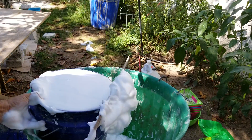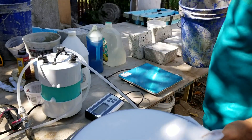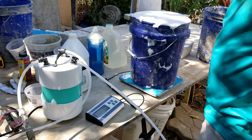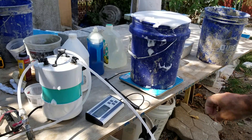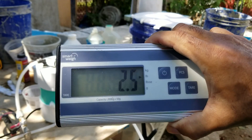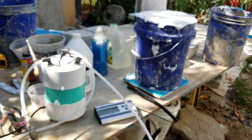Let's take the top off and swing over to the scale here. I'm going to show you we're zeroed out. This is three pound density foam — I say three pound density because it's three pounds to a five gallon bucket. It went back up — it's 2.9. That's actually the perfect consistency foam you want.